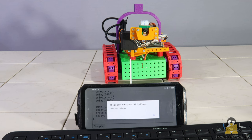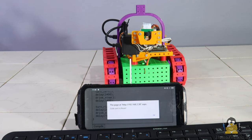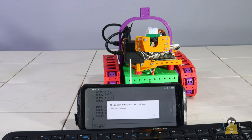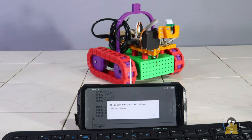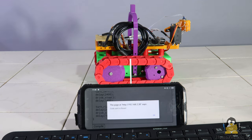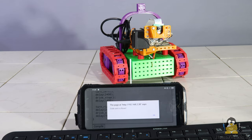Of course, the mega board with its 54 GPIO pins is not brought to its limits yet for the basic functions installed so far — for example a nano board with an ATMEGA 328 chip is sufficient. The pins that are currently unused will be connected to peripherals in later chapters in order to be able to record sensor data or add actuators. The mount grid on the chassis offers many attachment points for additional hardware.